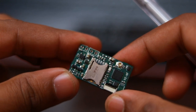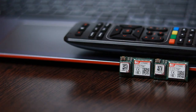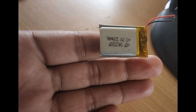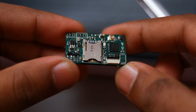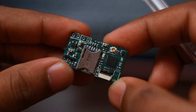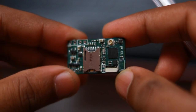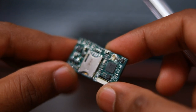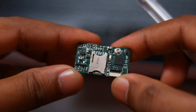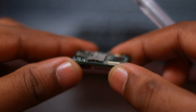So what do these results mean? Imagine if you put your V2MF device with a battery inside your pet's collar or laptop — you could track it for about 1.5 to 2 months on this tiny battery. Firmware can also be modified to switch to fast tracking mode by sending a command to the device when it pings every day. If you lose your device and it's still running at one ping per day, you send a command, and it will check the command the next time the interval comes up and switch to fast tracking mode so you can find your asset.